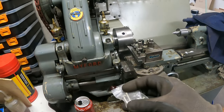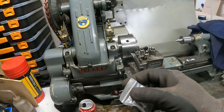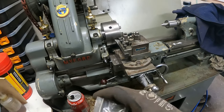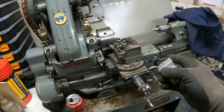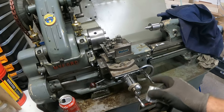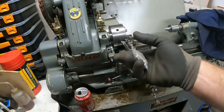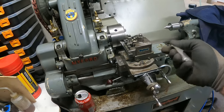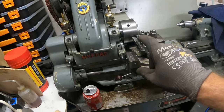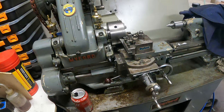That's going to do the job. It's not going in very deep. And the idea is not to have something that will stop a train. It's just a visual guide for me to run into. The idea is not to run the automatic feed into it, because then you'll break other stuff. You just get close to it, disconnect it, and you can wind it in with the hand wheel, closer to where you need to be, or bang on to where you need to be.